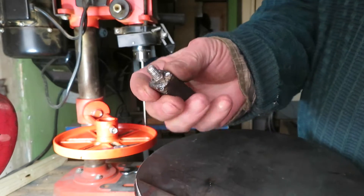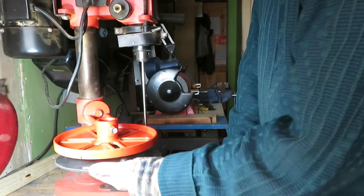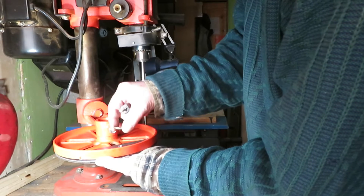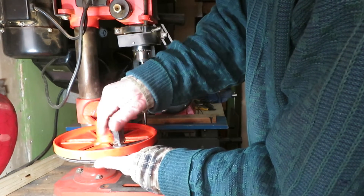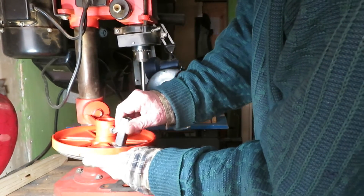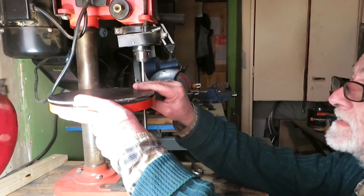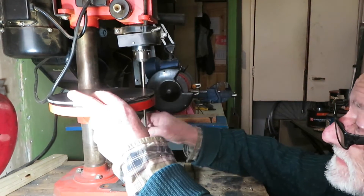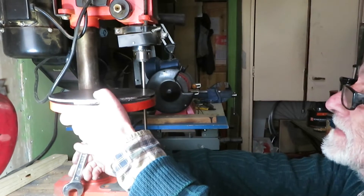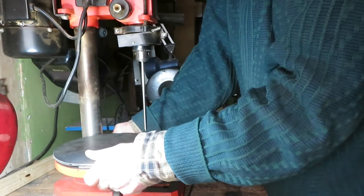Now we've got another arc to press it against the table to fix it there, and the nut — it wasn't the right kind of nut, so I had to weld a bit of iron on it. To fix it on the table we have to do this upside down. We put it underneath the table, place the holes where they have to go, screw on the bolt, fix it as tight as possible with our hands, turn this around, and tighten the adjustment bolt. We lower it and centre it.